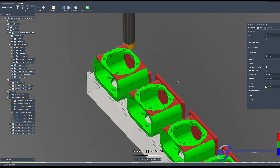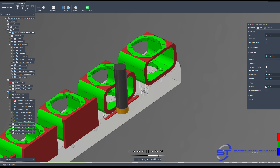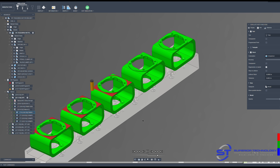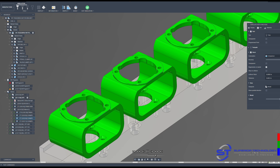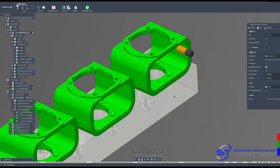And here, like you saw in the beginning of the video, just roughing it down with 35-thou step-downs, taking the extra material held on to off, and roughing off that boss for the end mill just so it only has to finish it. Finish cut with a face mill, finishing the boss on top, throwing some quick 5-thou edge breaks everywhere to make sure every single surface I can get to is chamfered.